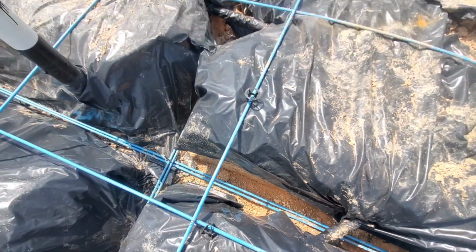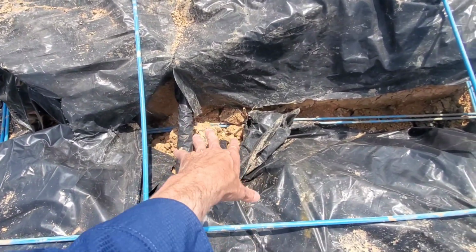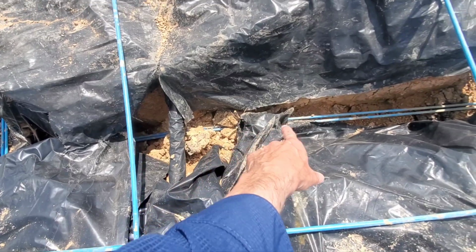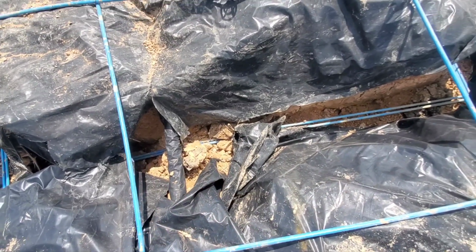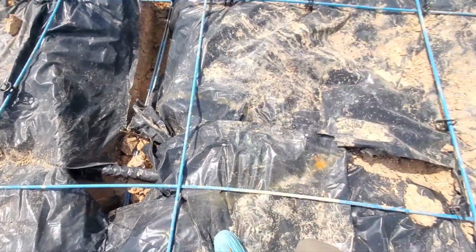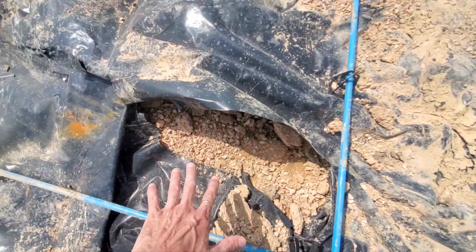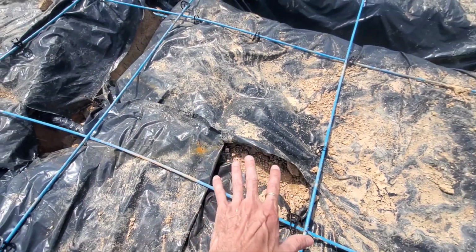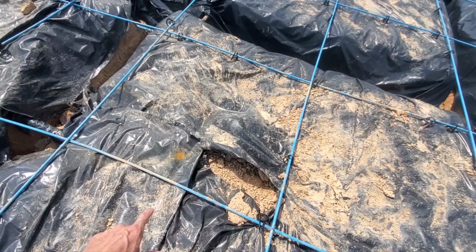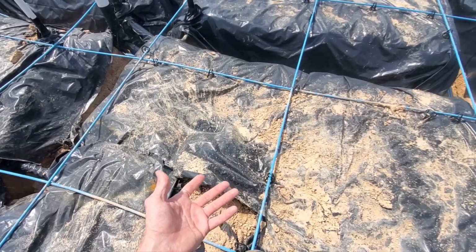Now, there's a few other areas where the beams have collapsed. They've caved in here right on top of those tendons. What a mess that is. And then a few other places where this vapor barrier is torn. You've got just a bunch of dirt. This isn't even flat. This is gonna affect the depth of the slab, and the vapor barrier can actually allow moisture to lift up through into the slab.